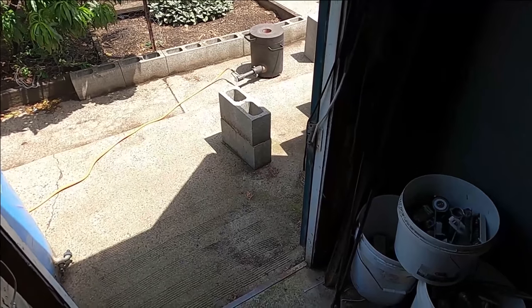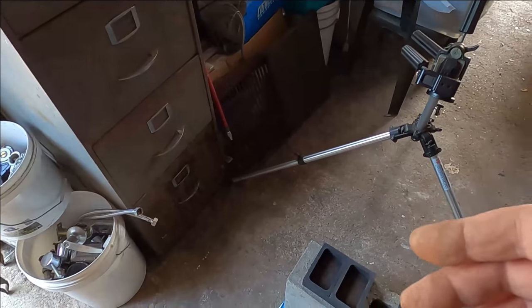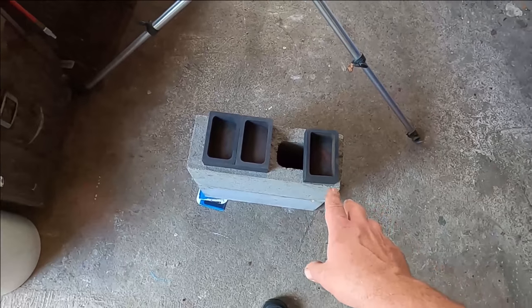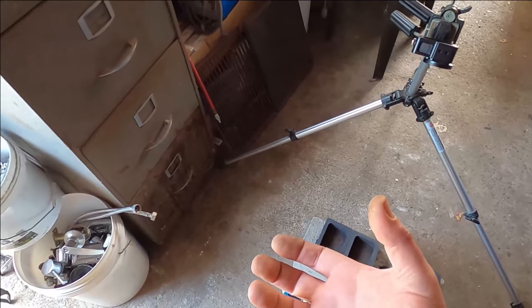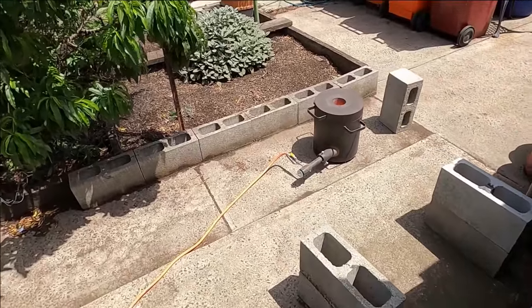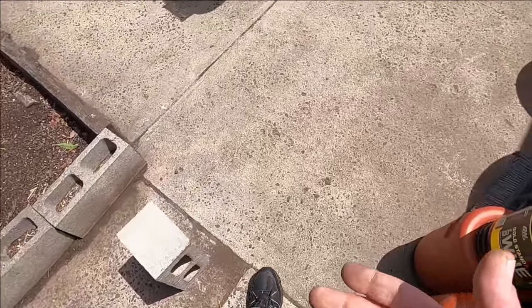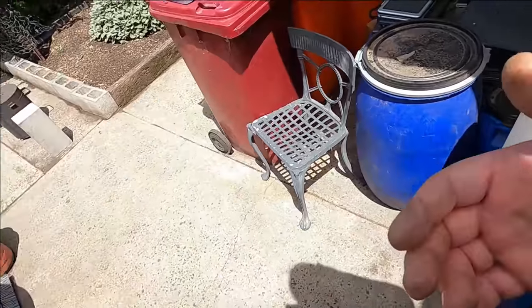So once you start rolling, if I was going to do three or four different batches, I wouldn't have a spare mold just for the leftover until the end, because I would leave what's left in the crucible, so it's already at melting temperature, and I'd put it straight back in and start putting more copper into it, and it'll go really quick. The first time is usually quite slow. It seems slow because it takes a long time for the crucible to get to copper melting temperature.